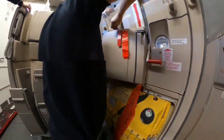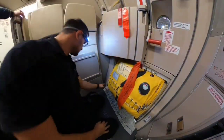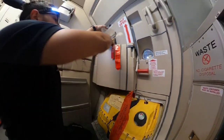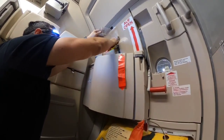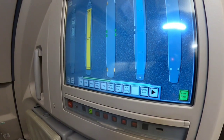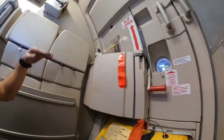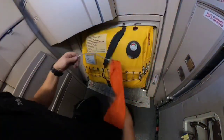I also need to cross-check if the floor indicator moves to the arm position and through the disarm position. Whenever everything is okay, I'll install the safety pin and we can proceed to the test. First of all, we need to close all CBs. My colleague will operate the doors in the back while I check the indication on the FAP and on the ECAM. I also need to perform a test of emergency lights and an operational test of the inflation reservoir monitoring.